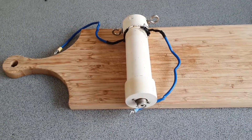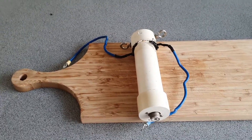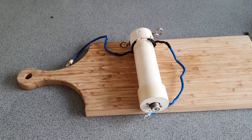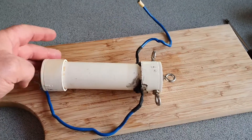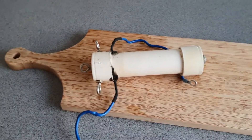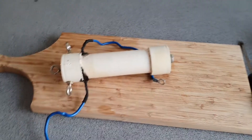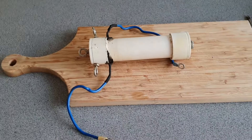Now the type of balun that came with it — or I was told it was a balun — the seller was none the wiser; that's not his problem. He was informed that it was a 1:1 balun, which is pretty common in the market, so one would assume that it's some sort of transformer match inside giving us the 1:1 matching from the unbalanced line to the radio.